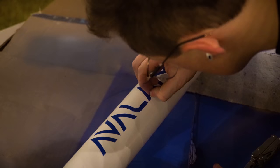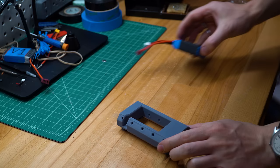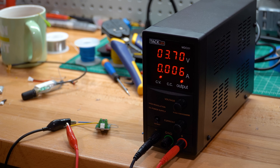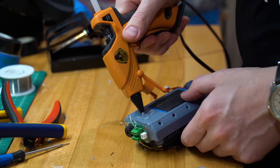The goal with Avalanche is to test AVA. AVA gets mounted to a little 3D printed housing that I made. The housing has space for a beefy two-cell lipo on the back, and on the bottom I mounted an Altus Metrum Easy Mini, which is a commercial dual-deploy computer. Since we're testing a lot of experimental code on AVA for these flights, I didn't want to put AVA in primary control of the parachutes, so that's why we have the third-party computer on there. The current draw on this board is basically nothing, so the battery for it is an itty-bitty one-cell 100 milliamp-hour lipo.